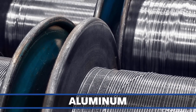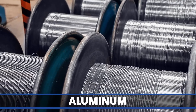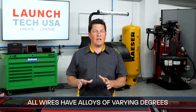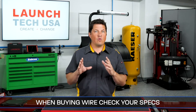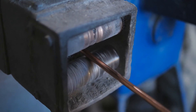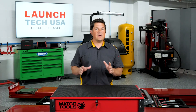Aluminum: Many of the same considerations are involved in selecting aluminum wire. The series and alloys must match to have good weld integrity. Vehicle manufacturers call for specific wires and equipment to also ensure proper repairs. It is important to note that all wires have alloys of varying degrees. When buying wire, check the specifications on alloys and percentages, as weld quality is affected dramatically by these factors. Many manufacturers produce wire that may be too low of a grade for automotive use.